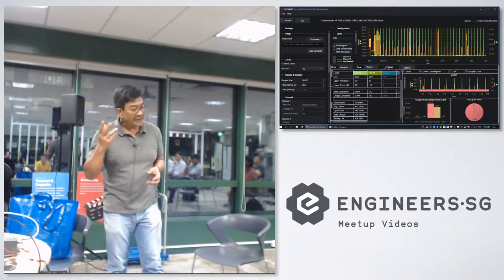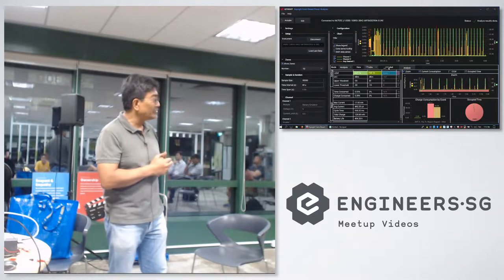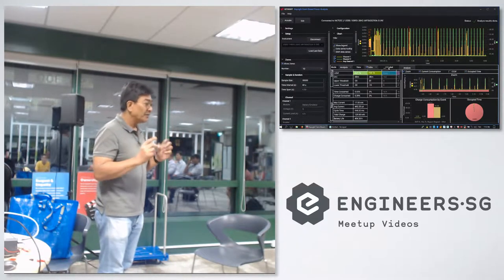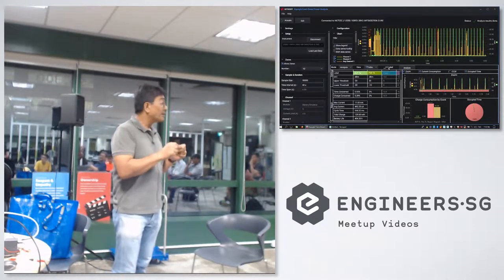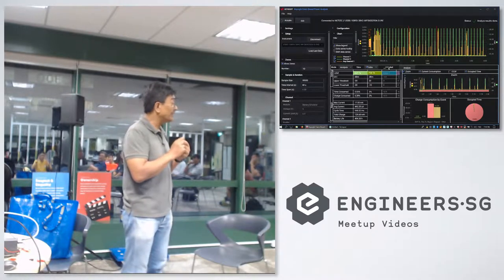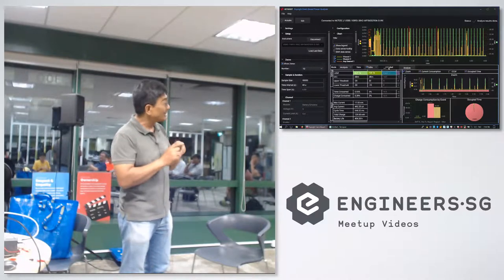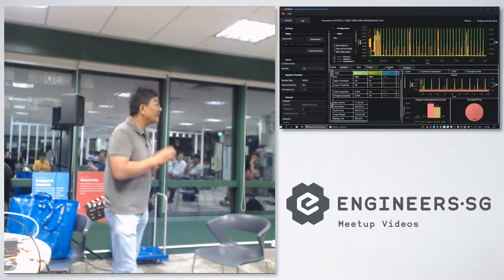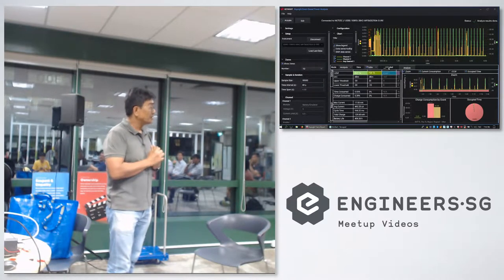From my talks last time, my gadget was based on the ESP32. The power consumption was quite low — maybe less than 10 micro-amperes. For that project, the power regulator used was a switching step-down regulator that consumed less than 40 micro-amperes, so in sleep mode that gadget consumed about 50 micro-amperes in total.